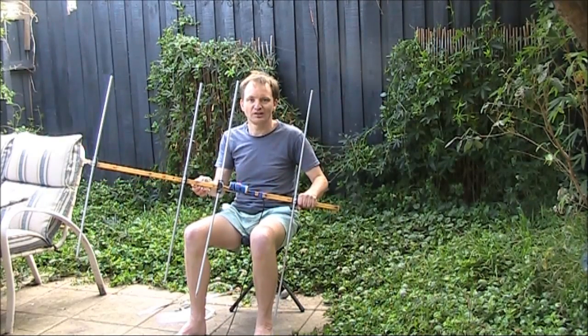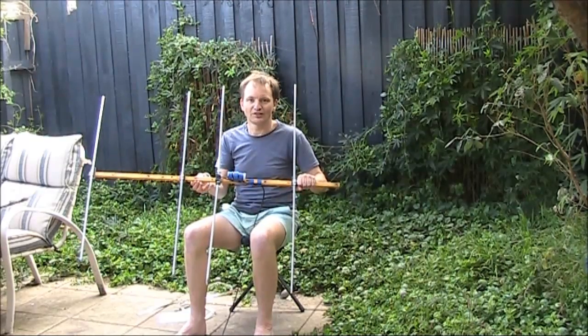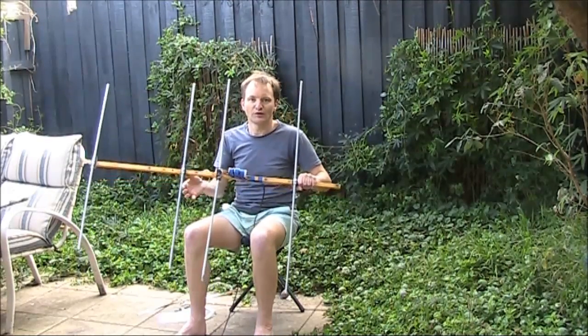Hope that helps — a quick description of the antenna. Highly recommended. I've had contacts of six or seven hundred kilometres just with five watts on two-metres SSB. So it's definitely something I'd recommend if you want something small, light, and easy to build for a VHF field day.